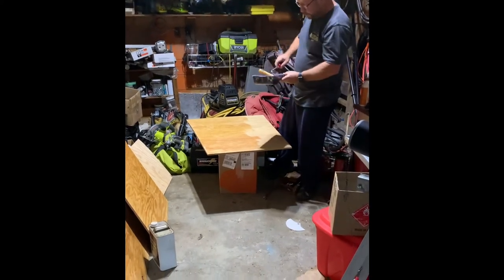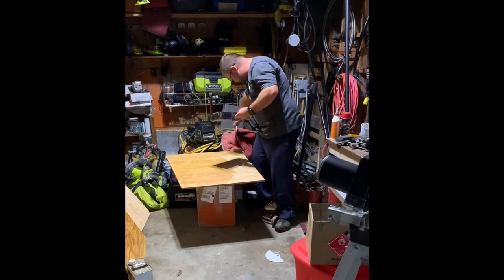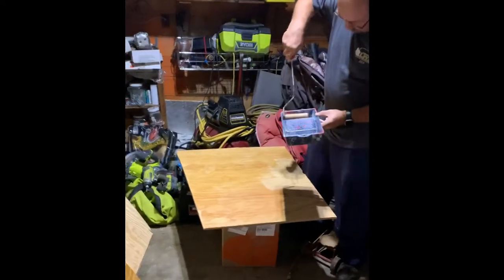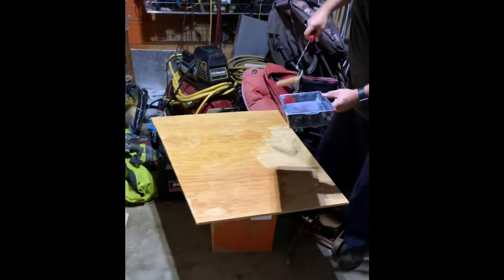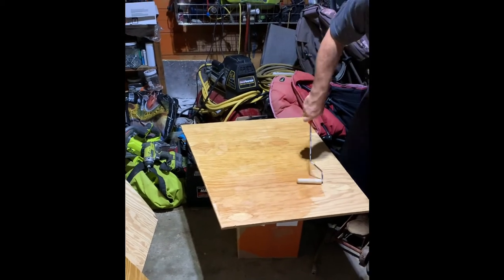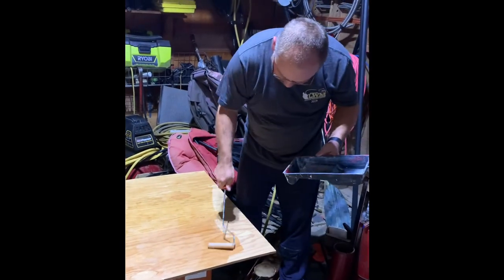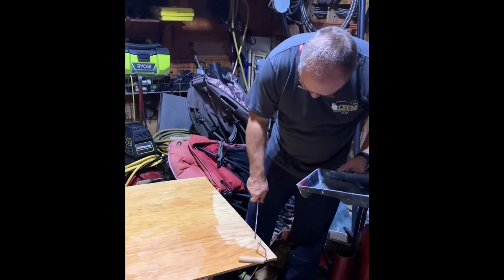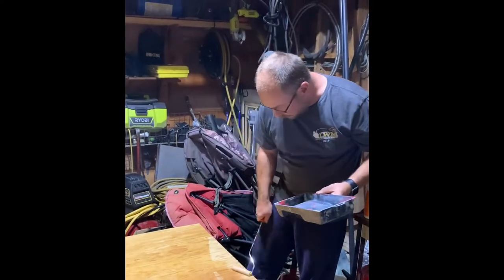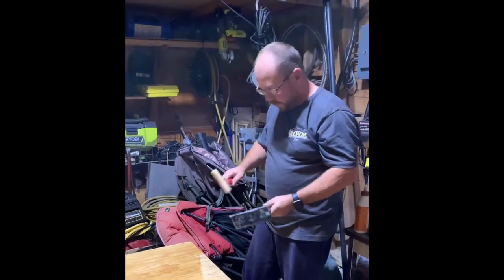Almost got her used up — good thing. When you are thinning it, you don't want to thin it any more than about 5%. If you feel lucky you might get away with 10, but I wouldn't go there.